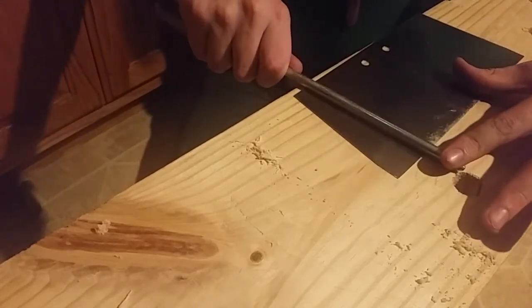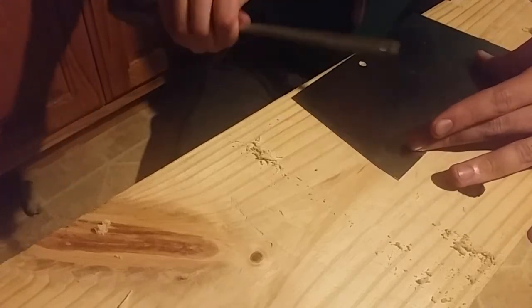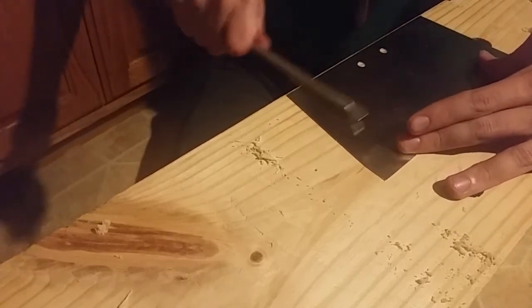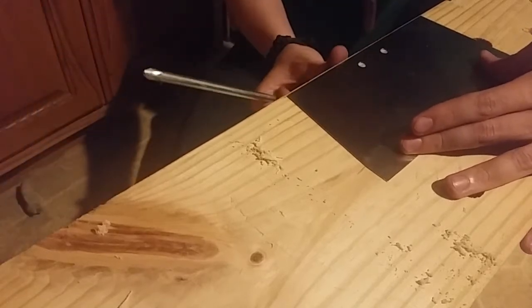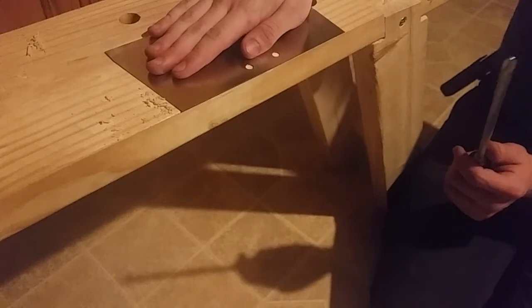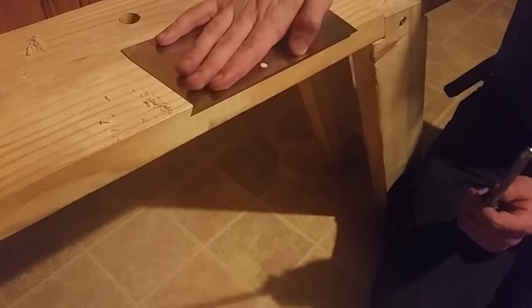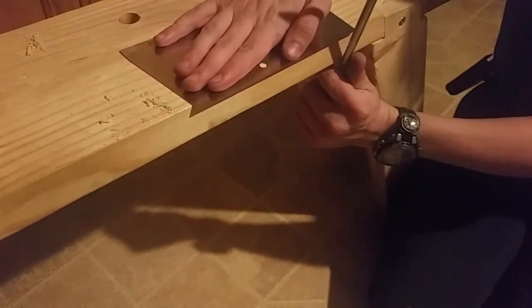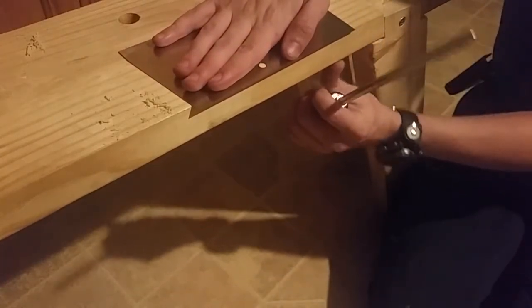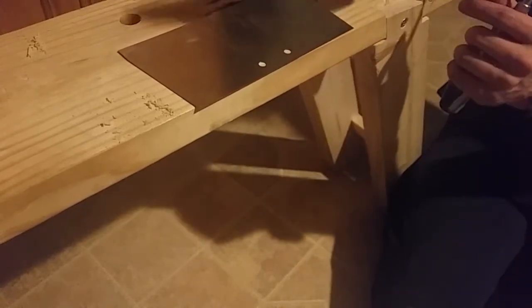Get it almost flat and up very slightly and turn the initial burr. And I've got it right almost on the edge right there. There's a little bit of a gap. Then, instead of trying to get it upright and turning a burr that way, I'm hanging it over the edge, supporting it with my fingers, and setting it against this corner right here, so I can very finely control my angle while I'm looking down it this way,